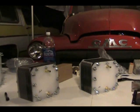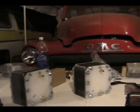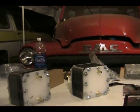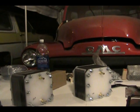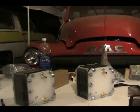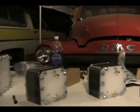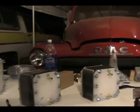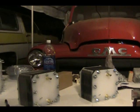That's the basic features of it. This cell is inherently strong — it's been tested to full flashback. The gaskets hold, the plate system holds, the bolts hold. All in all, it's a very easily reconfigurable cell. It keeps all your electrical connections outside of the gas space, and that's very important.